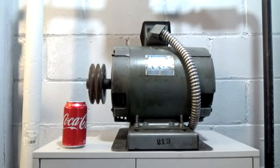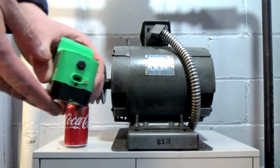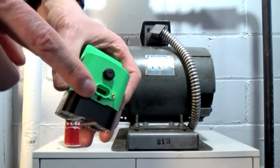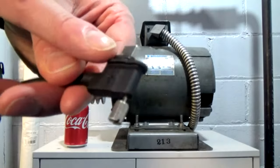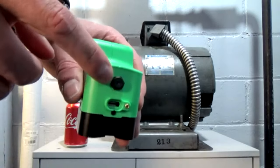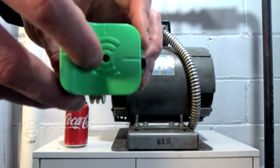I have a small motor here in the room with me — a seven and a half horsepower Marathon with a little pulley on it. Just to give you a sense of scale, I've put a can of Coke here. Here's the sensor itself right next to the can of Coke. You can see this port on the front — that's where we plug in our harvesters. It's a USB-C pinout like you might see on some cell phones or laptops, but to make it waterproof we add a gasket — a rubber gasket material and a safety screw to make sure it doesn't get yanked out. This little shield on the front, this black button, is made out of Gore-Tex, which allows us to get temperature and humidity readings without compromising our waterproofness. We have a little wake-up light on the top that gives you a heartbeat when the sensor's on so you know it's running.